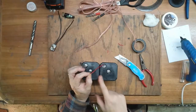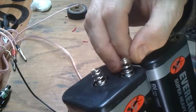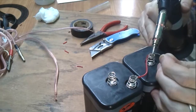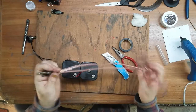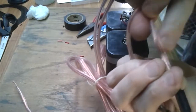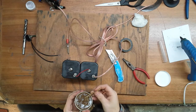I'm going to use this piece of wire to run these batteries in series — from the positive of one battery to the negative of the other. These batteries have a little springy top and I can pinch the wire in there to hold it in place until I get the solder there. This is speaker wire — just some wire I had a good length of. My negative wire has the writing on it; speaker wire is typically blank on one side and has writing on the other, so writing is negative. We'll find the other end with writing on it and that goes to the negative terminal. Get a little flux on that wire so it flows nicely.